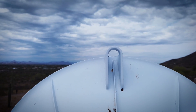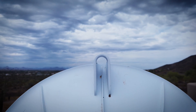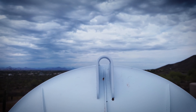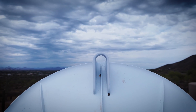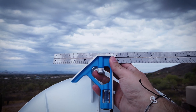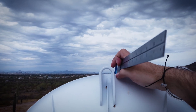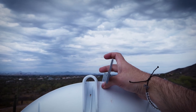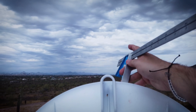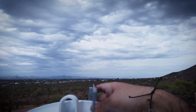So there's a little bit of bonus content — how to aim these things. I was using this thing as a peep sight. Yeah, that's not even close to accurate enough. What you need is one of these — a carpenter's rule, or a carpenter's square. What you do is you put it on the flat side of the antenna and you hold it on there. It's hard to do this one-handed. And you look down the thing like a sight.